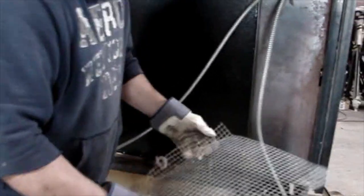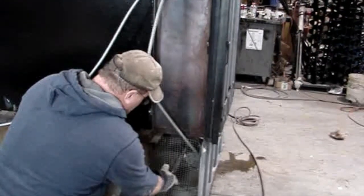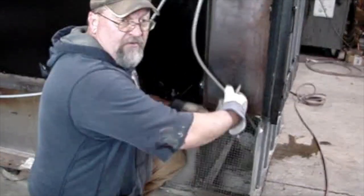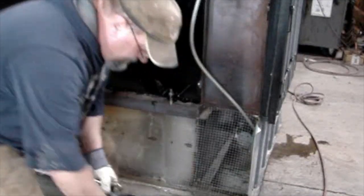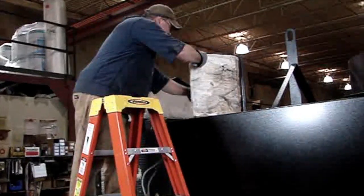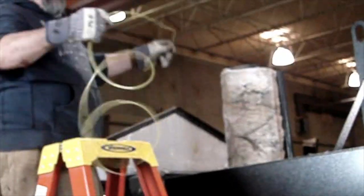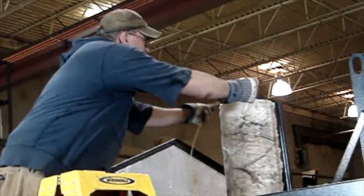And then once that's done, before you start insulating, you want to make sure that you put your chicken wire back in. What that does, it just gives it a little bit cleaner looking where the combustion fan sits. There's a piece of wire on either side. That way when the insulation comes down, it doesn't poke in where the blower fan sits. So, reinstalling the chimney wrap, and what that does, it protects the fiberglass insulation from the heat from the furnace. And in most cases, the wire's in pretty bad shape, the old wire, so I recommend to have new wire.